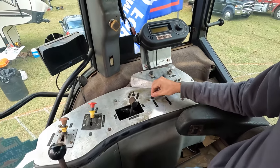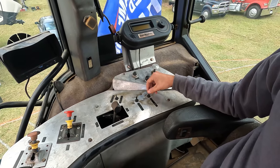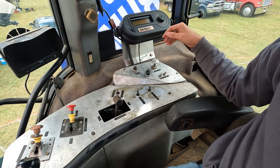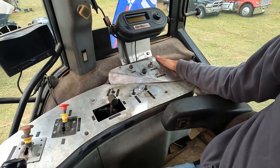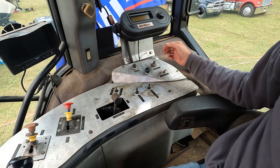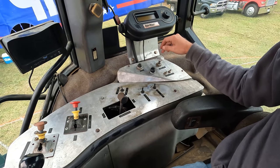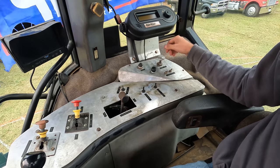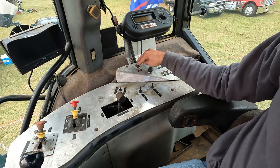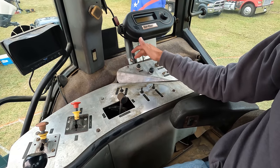There are lots of toggle switches. This one is for our steering wheels up on the pan. This is for pan lift and pan reset — you run the box back, you've got to pick the pan back up with a flip of a switch. Red and green Christmas tree light switch. Over here is our 'having a bad day' panel — pan drop and push down emergency switches. Either one will drop or activate the push down on the pan and will also turn the green light off and the red light on. Box brake: if a chain were to break or something in the driveline gives way, you smack that down to lock the box in the rail, which also gives a red light and turns the green light off. There's also a kill switch up front that will kill the engine but does not give a red light.